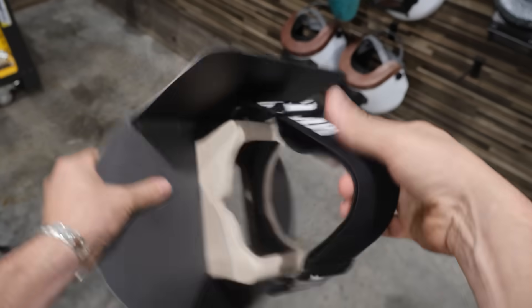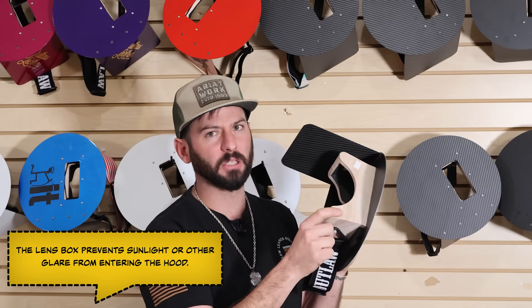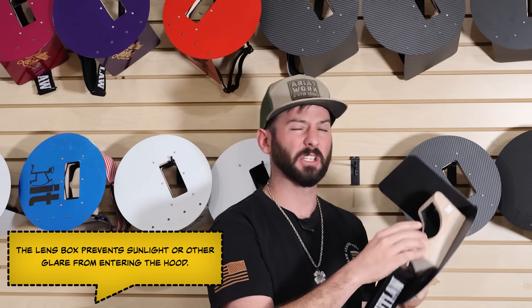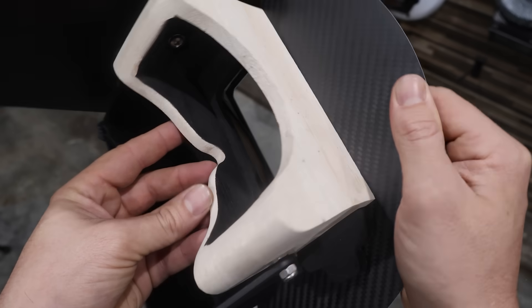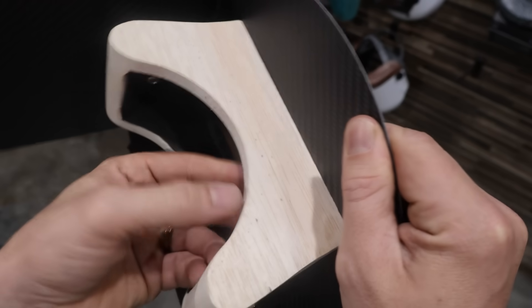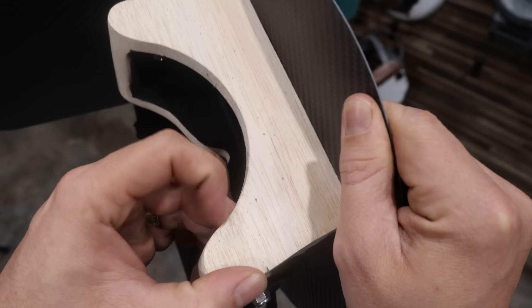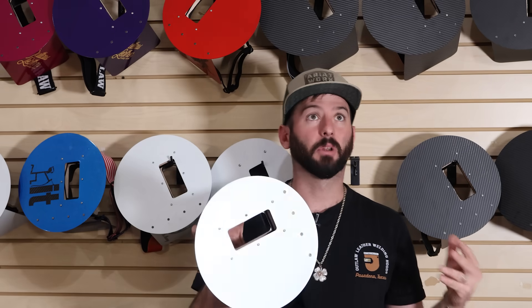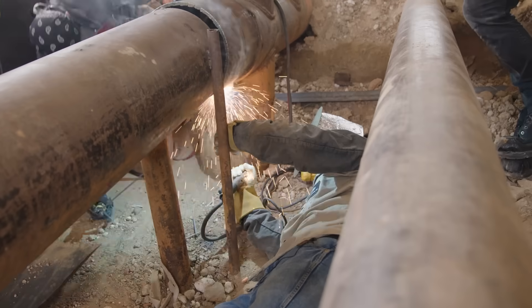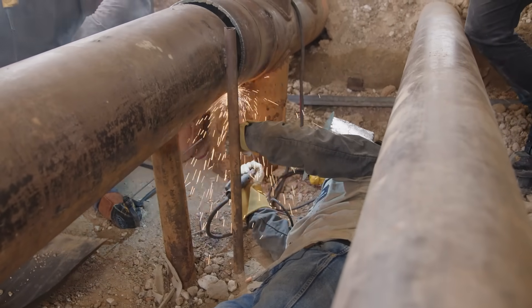The box on the back is usually made out of balsa wood — it's really lightweight, soft, and malleable. You have to actually form it to your face, doing some light sanding so it really fits. When that wood gets broken in and used, it's honestly really soft. You can also adjust your strap on it. The funky design is meant to keep a lot of spatter off the welder, especially with the type of welding that most pipeliners do.